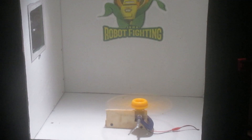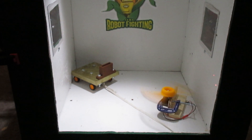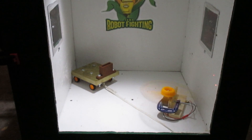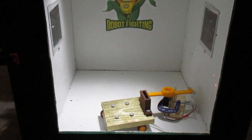Let's move on to the weapon tests. The initial spin-up of the first test weapon went off without a hitch — we saw no major vibrations or issues with the weapon, however it was spinning up a little slower than we actually wanted. After the initial spin-up test, we moved on to an impact test using a test block with 10% infill for 3D printed materials. It performed relatively well, however the low speed of the weapon caused a bit of an issue with sticking.